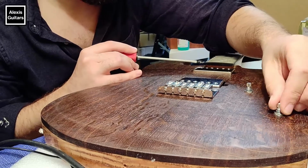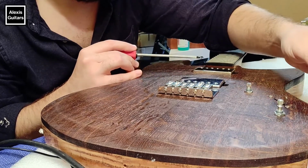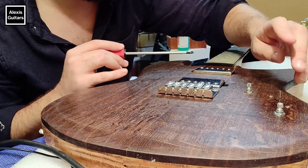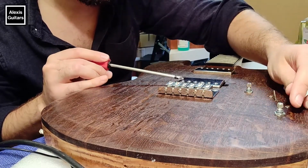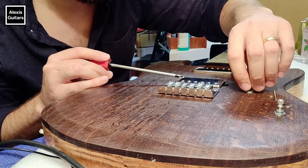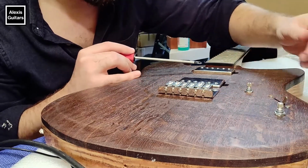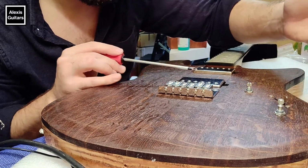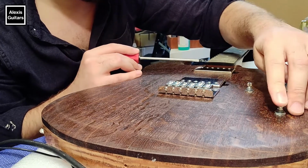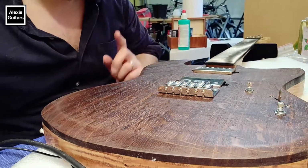In this position, that's fine, but when I lift this up, everything cuts. So the thing that doesn't work is the straight to output mod in the neck position. In the bridge position, it works. If I lift it up, the volume knob does absolutely nothing, which is good. Same with the tone. In the neck position, I get no output whatever. Same here. Okay, so I need to fix that one thing.